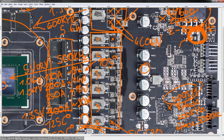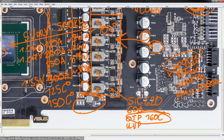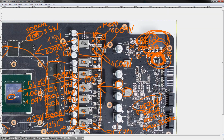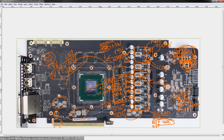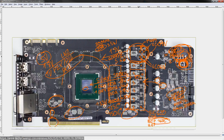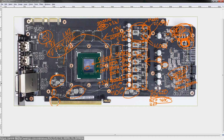And then somehow it gets from this part of the board to this part of the board. It's a multi-layer PCB. I can't see the freaking layout. And then it goes into your Vcore VRM, and your Vcore VRM is literally hooked into just the 8-pin. The PCIe slot down here basically powers the memory. Yeah, the memory VRM. Probably these guys down here, as well as the fan.